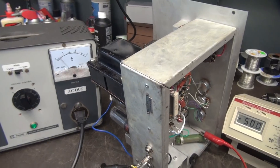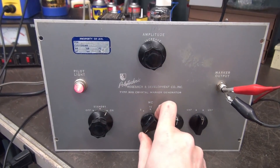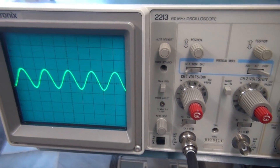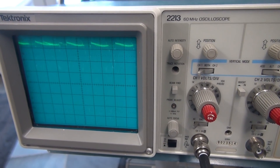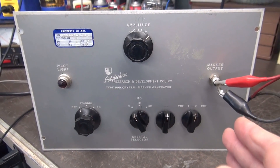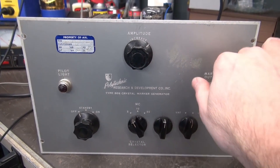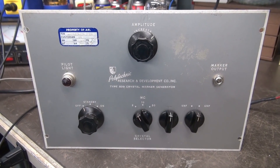Here she is fired up at full voltage, coming in with a one kilohertz signal. There it is on the scope. When I really crank it, the top starts rounding a little bit, and then it goes right into an oscillation that appears to be in the preamp circuit — if I bring back the master, I can still do it. So I'm going to take a look at the signal routing in the preamp section. We had the 6C4 in there and the wiring is kind of dancing over the top of the 12AX7 — that's probably it. I'm going to remove the 6C4 and clean up that wiring to fix the oscillation.